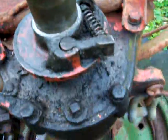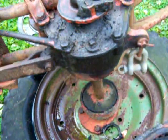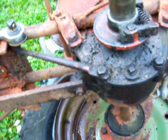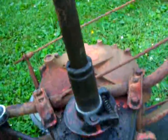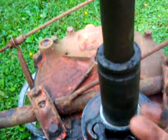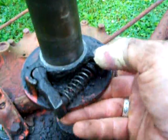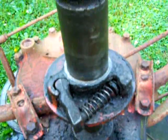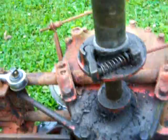The other thing I want to show you while I have this open: a lot of guys don't know — you look at some David Bradleys and you don't see the axles sticking out, and you look at others and the axles are sticking out. That's because they're adjustable. The whole thing slides — you can bring your wheels out all the way for cultivating, or bring them in all the way for a tighter, stronger force on the transmission for plowing. It's adjustable, and it's just one key that goes into the slot that holds it in place.